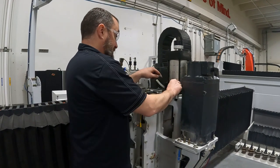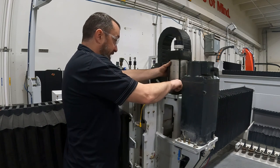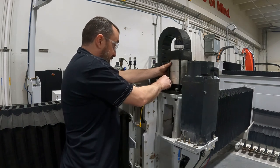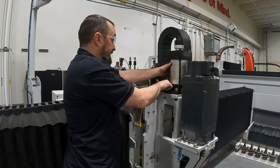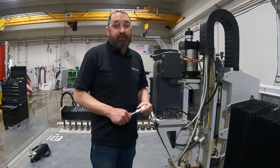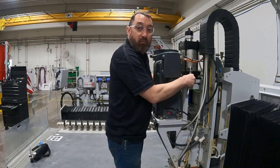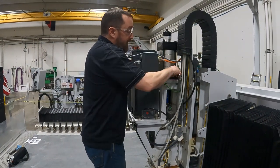We're just going to start our bolts here. The cylinder is extended a little bit, so you can see it's sitting up a little — I'm just going to start my bolts to make sure nothing falls off, and hook up my air lines. Once I turn my air back on, that will retract in. Now that we're powered back up and have our air on, we're going to go around and snug these bolts up. Try to keep your distance even on the front edge so your air cylinder is not sitting crooked.